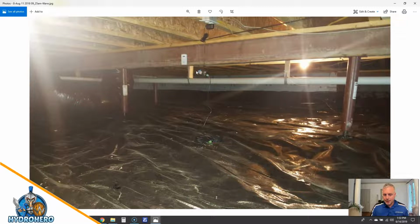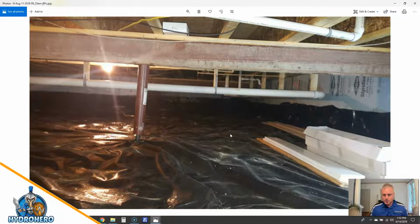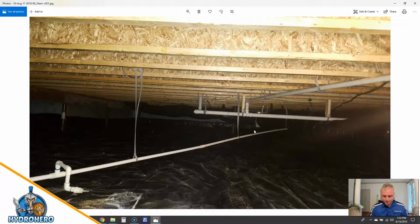We had put a moisture monitor system in here, and we just put that in prior to, so we can check the conditions of what this crawl space was like before and after we started. So we just got that temporarily hanging there, and you'll see all that as we go through here. So the vapor barrier doesn't go all the way up the wall, no termite inspection gap there, but sealed for the most part, pretty decent. Just aesthetically doesn't look all that great either. And you can see all the wrinkles and everything. Nothing's pulled tight or anything of that nature.